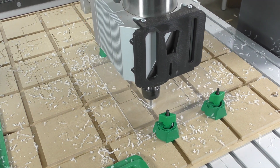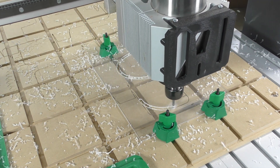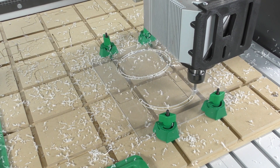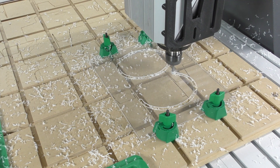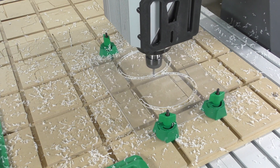A completely separate program needs to be made to cut out the plastic windows. I'm actually using the same quarter inch bit here — it's a downshear bit with a slow spiral. The downward cutting pressure keeps the flexible plastic from lifting off the bed.